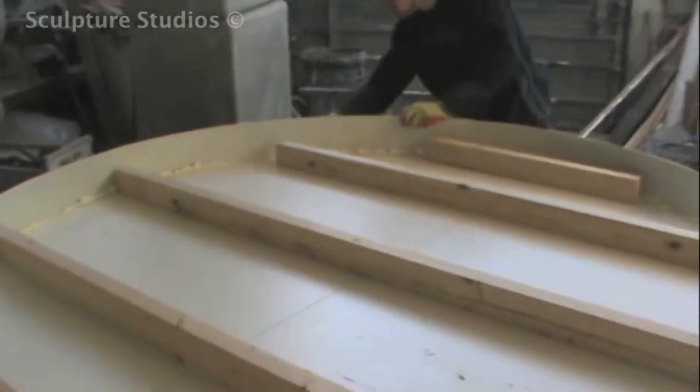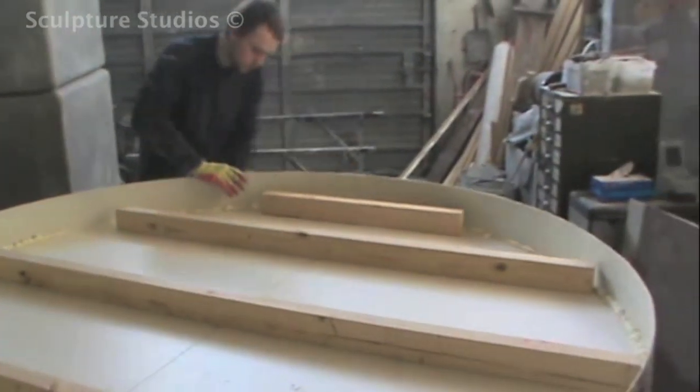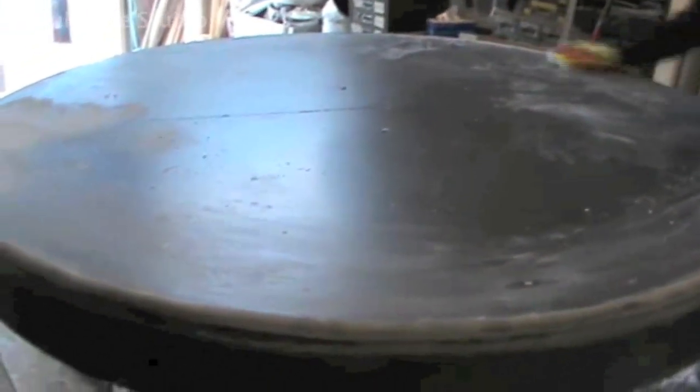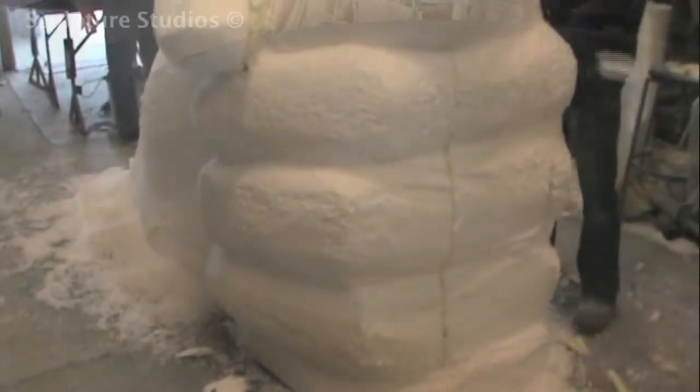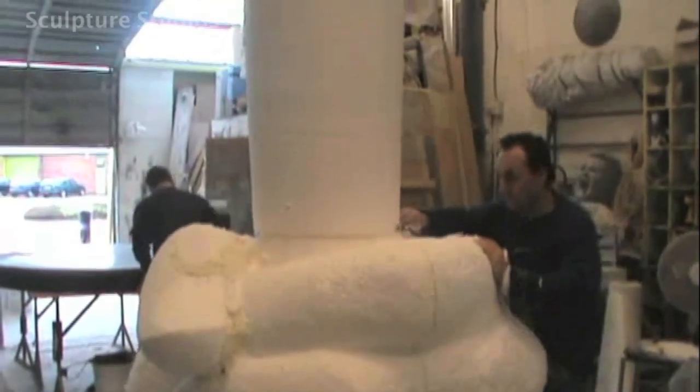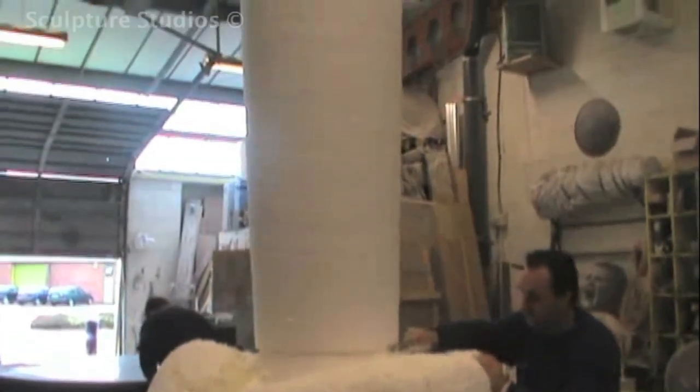The cast of the base is released from the wooden mould, and the battens are fixed in. All the surfaces are sanded down, repainted and sanded again and again, to ensure a really smooth finish. All of these sanding down processes take a long time, but it's a necessary step to produce a decent finish without a solid production mould.